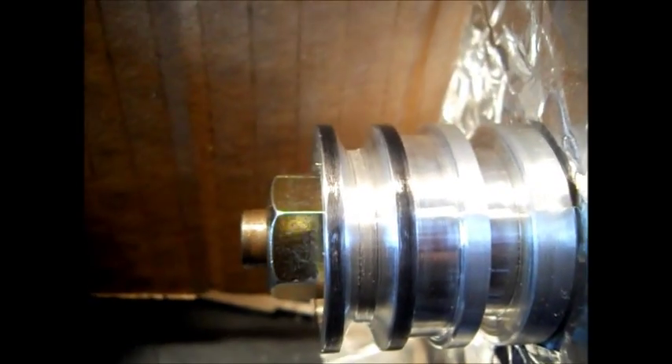I don't know if that's exactly right — that's what the other one looked like on here. I tried duplicating that and it came out almost exact: 4 millimeters wide at the bottom, 6 at the top, and 6 millimeters deep. So it's just about as deep as it is wide.